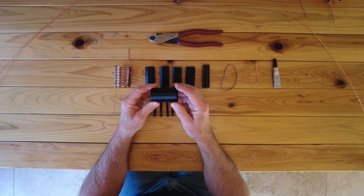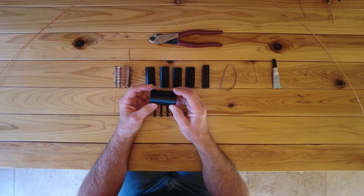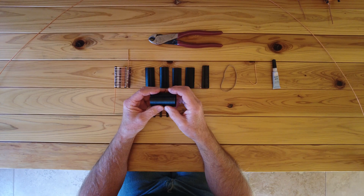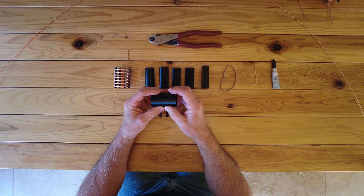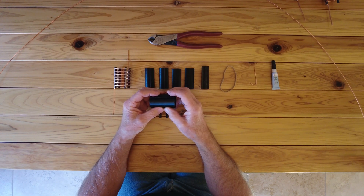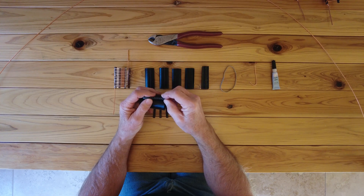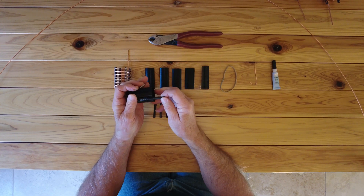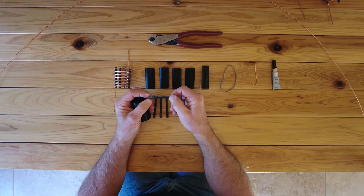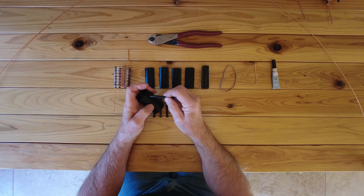This end is larger than this end by a little bit. There are four slots around here, and I modeled this form in a free and easy to use program called OpenSCAD. It's a parametric program where you define an object by statements and numerical values — great for geometric type shapes. I also modeled these strips that go into these slots and slide back and forth. These strips have slots in them for the wire of the windings to make the coil.